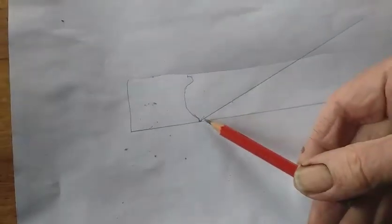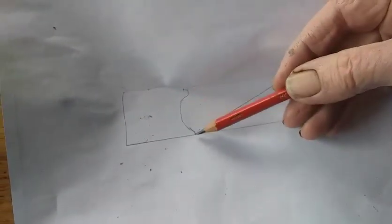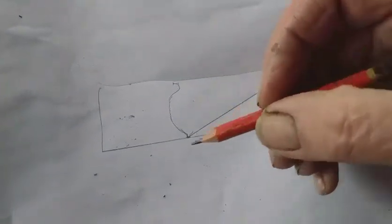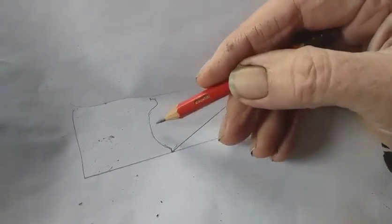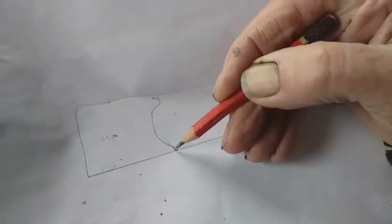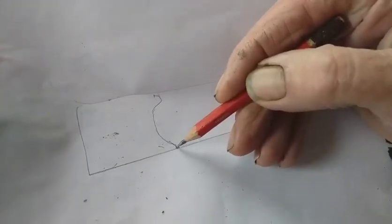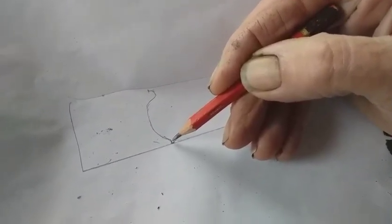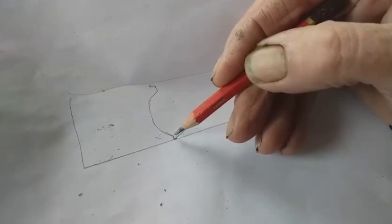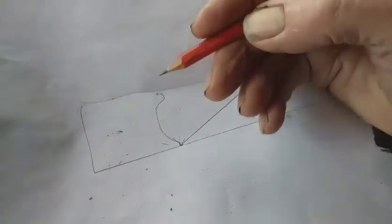There's the bed angle, and there's the front infill in front of the mouth. Whatever shape you do on this front infill, finish up in the sole metal with a little right angle there, because that's the bit you will have to ease if you want to open the mouth up. So you don't want a lot of metal there — a small amount. A sixteenth would be plenty.